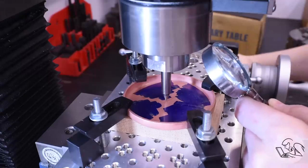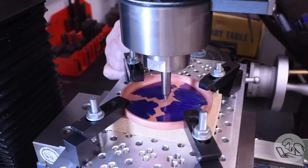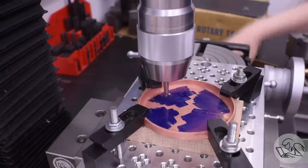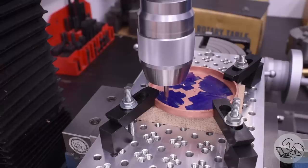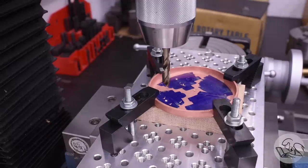There's still a very light punch mark in the center of that that was used for various setups until now, and it's going to be useful once again to get me centered up on the tube sheet so that I can position all of the various holes that are needed here. There's some mounting studs for the smoke box, and there's a couple of steam ports for the blower pipe and various other accessories at the front of the engine.